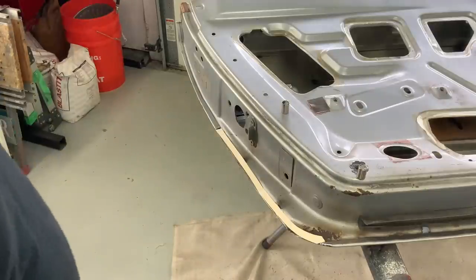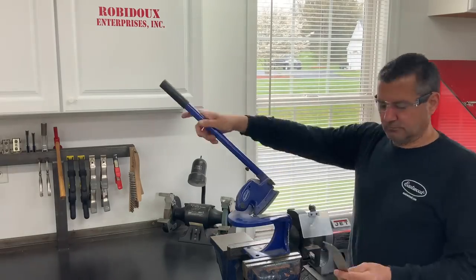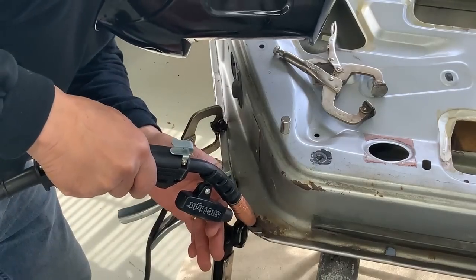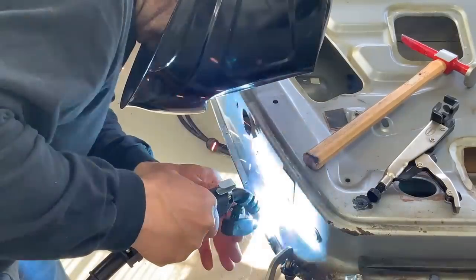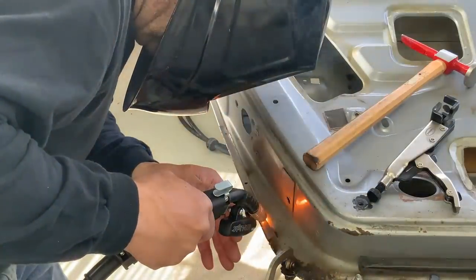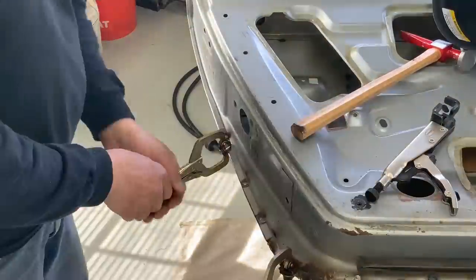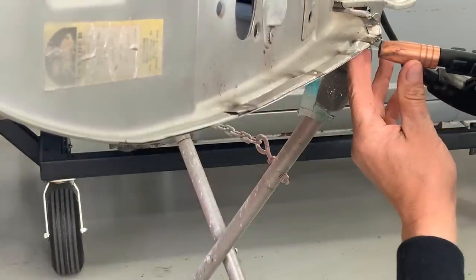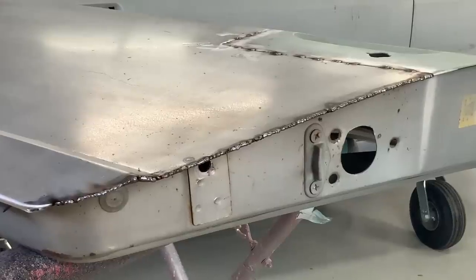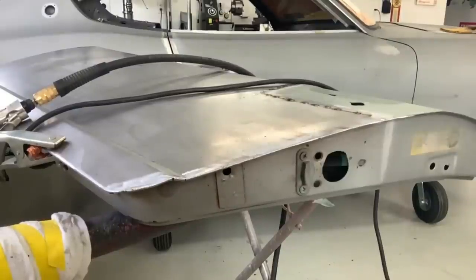You can see how easy this process is — there's our piece. We're going to transfer it to metal, and that'll complete our inner door skin flange. Transferring my paper template to some 18 gauge, I cut out the piece, then drilled some 3/16 holes in it and clamped it in place to go ahead and plug weld. Now you simply weld the edges together, skipping around just to keep the heat from being concentrated in one area. Once fully welded, simply blend it — use long continuous motions so that you keep the edge nice and straight.